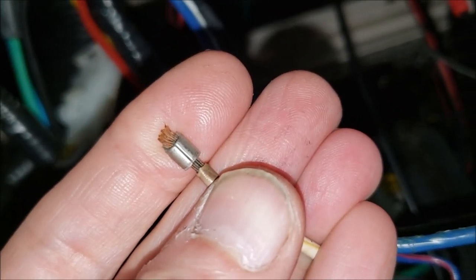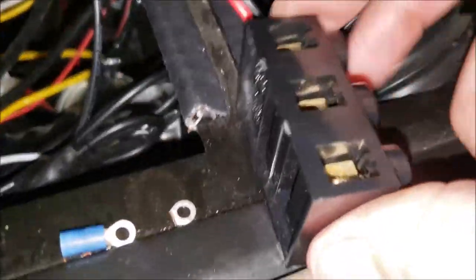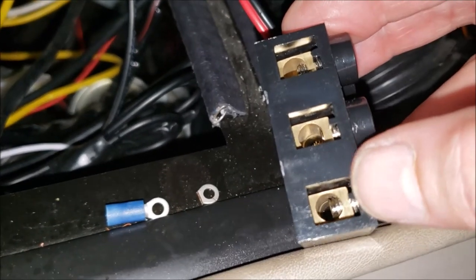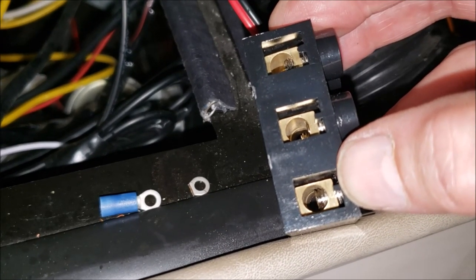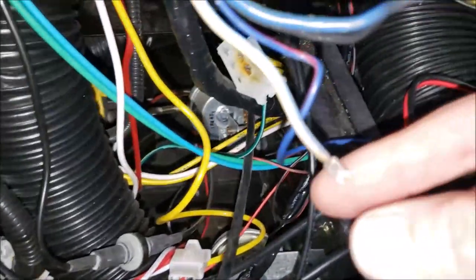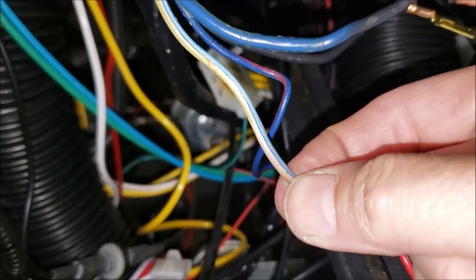See, there's the crease — that makes for a really good connection. The reason I'm doing it this way is because we're going to be screwing down into this, where the screw compresses that connection. If I just stuck the wires in there and tightened it down, those wires would get cut, twisted, and probably half of them would break off. This way, the screw tightens down against this piece and compresses it good and tight, so I'll have a super good connection.